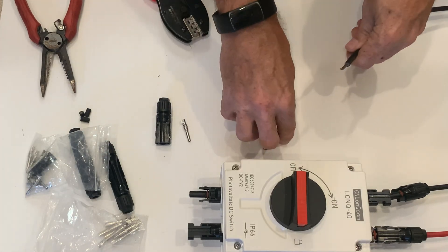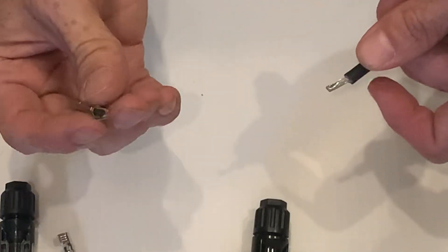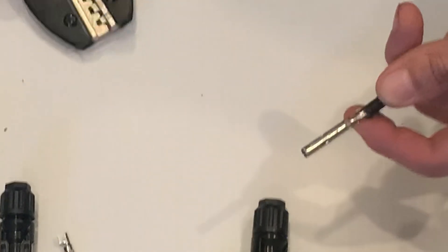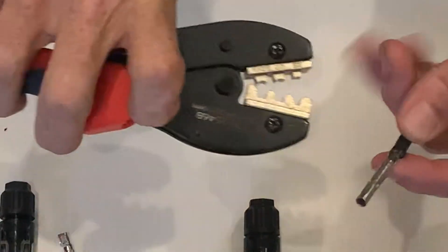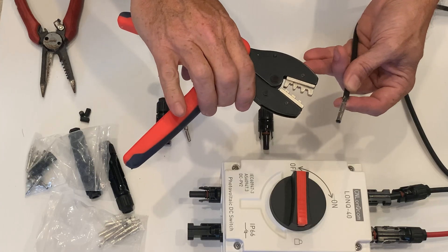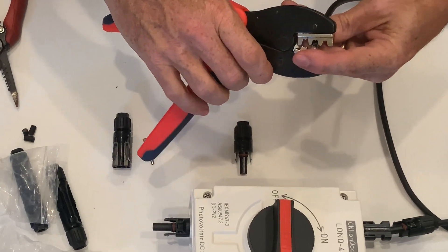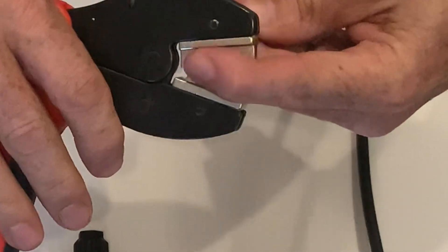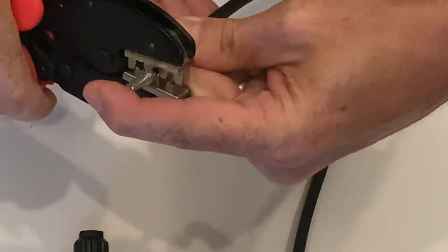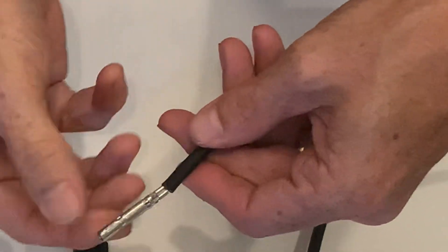This is very straightforward. We're going to lay the wire in the channel — you can see it's got two little wings that fold out. Lay the wire in the channel, make sure every strand makes it in, then pinch those strands a little bit close so they fit easily into the tool. Take this tool — it's going to fold those ends over and crimp them down into the wire. Make sure the wing side is in the top piece where they flip over and back into the wire. Line it up directly in the middle of the wings and in the middle of the tool. The width of this tool is exactly the same width as the piece you need to clamp. Line them up exactly, make sure they're in completely and firmly, then give it one squeeze all the way open and closed and it should clamp around that wire nice and tight.